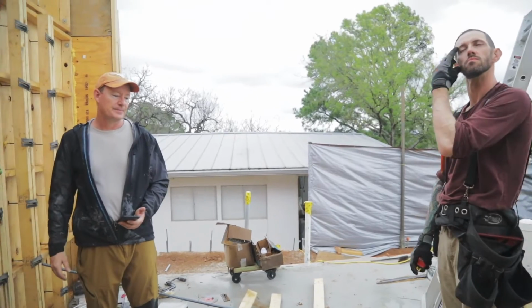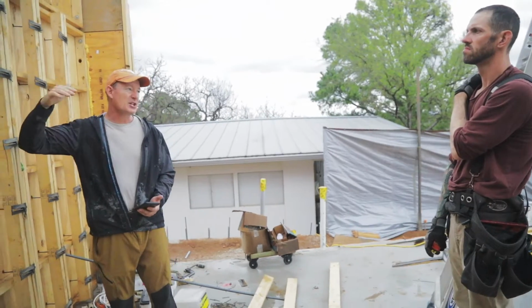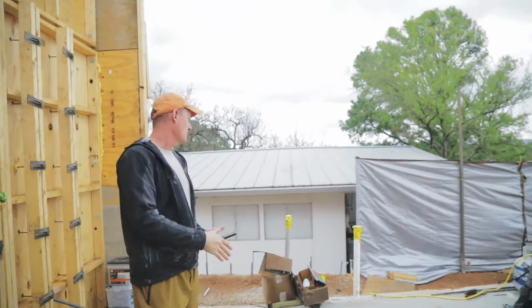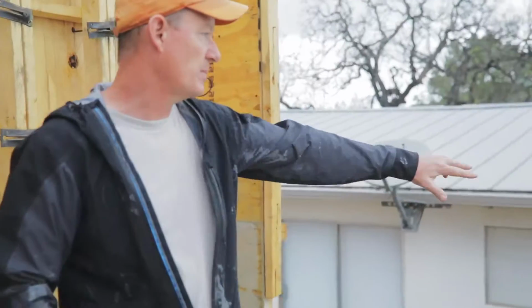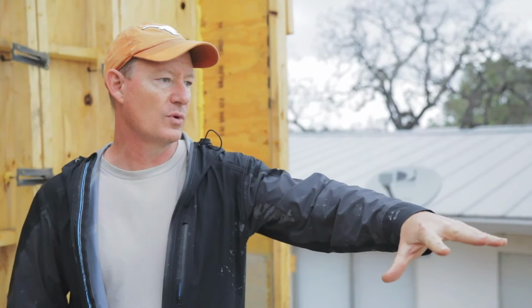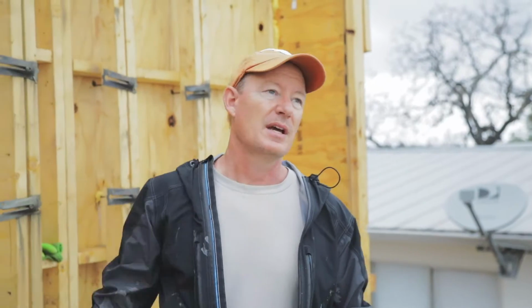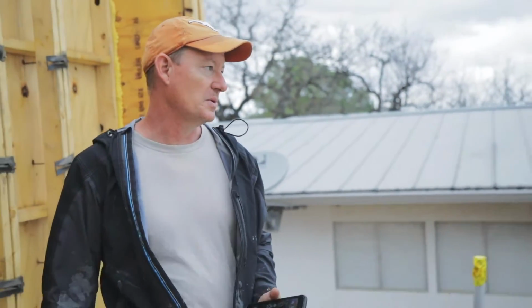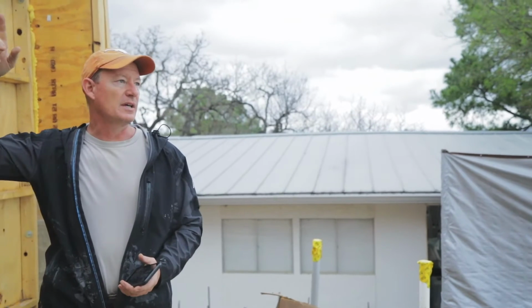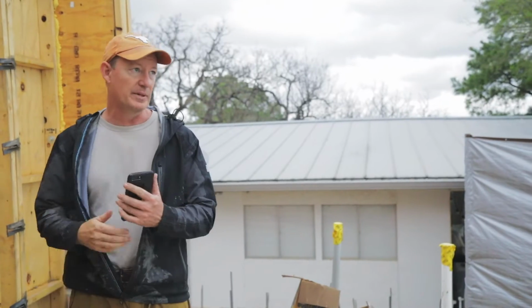Then I was going to talk to the framer dudes, get them out here and talk to them about lifts and staging and everything. Because wood down here, we could set wood on the slab if we can get it over here, pick those poles down and drive it in. With a big 10,000 pound sky lift, we can set the wood in here for them. This stuff is 9-foot ceilings. This stuff up here is 11-foot ceilings. The wood is actually staged up there in order. So the roofing material and the last stuff we need is in the very back. So it is organized a little bit.